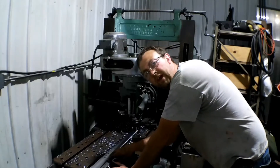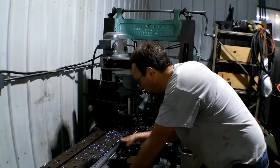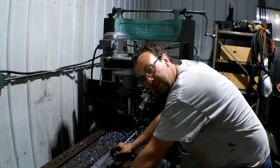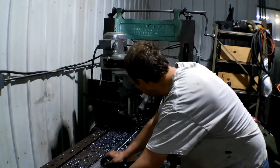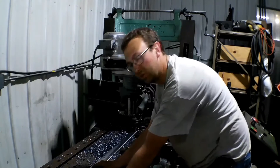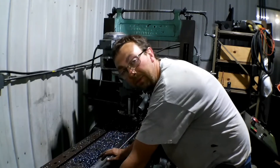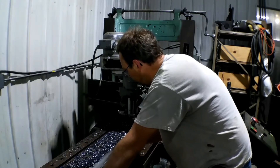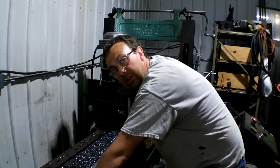While I'm running back to take my next pass, I'm going to measure this lip and then take that much again. When we're all done I'll take it off of here and just blend it with a seven-inch flap disc. Doing big stuff like this is not easy — it's a very difficult thing. Being that this is just a shim and it's not super precision, that'll be plenty for this customer. They'll be happy — more than happy just to be able to get something like this. I'll just blend it all together; it'll look fine and work good. We'll get it set up, take the last pass, and then we'll call it a day.